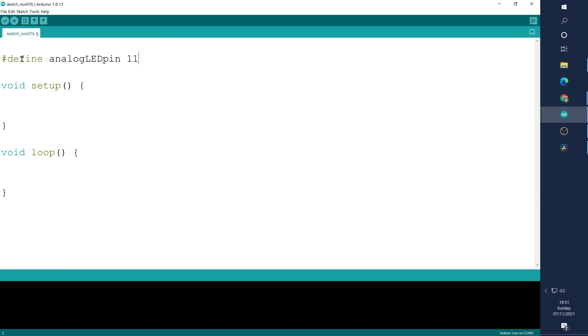What we plan to do is make our LED cycle through different brightnesses — starting dim and getting brighter. To do that we're going to have a variable that holds the brightness value. Let's create that variable and call it brightness, make it equal zero — this does need an equal sign and a semicolon. To change the brightness we're going to add and subtract a number; I'm going to call it increment and give it a value of 5.